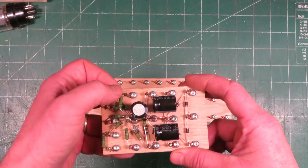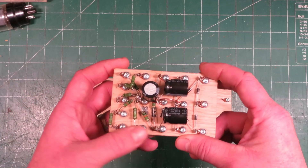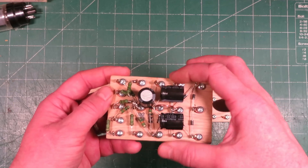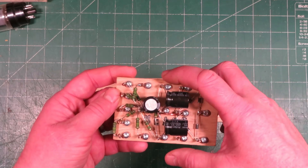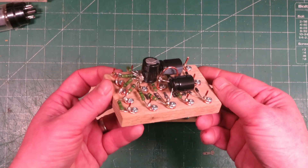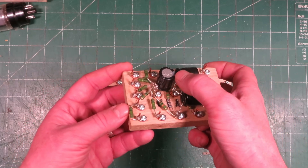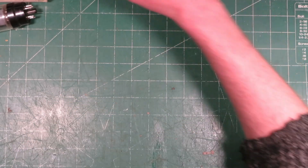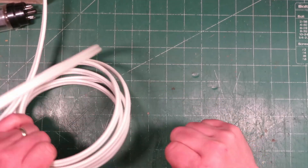There's a bunch of 100k resistors that go to the different plates for the 12AX7 tubes in the amp, and then there are a few different areas that go off to where the screen is, and over to the B-plus as well. That's what it looks like close up. I've also got a big ground rail right there, so it's really easy to find the ground on it.